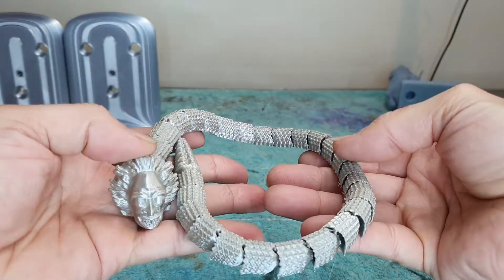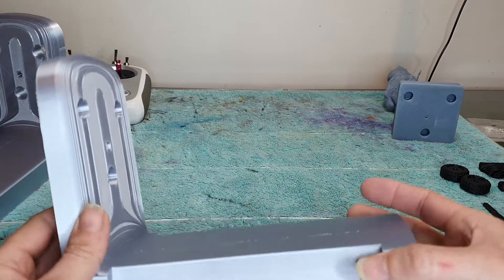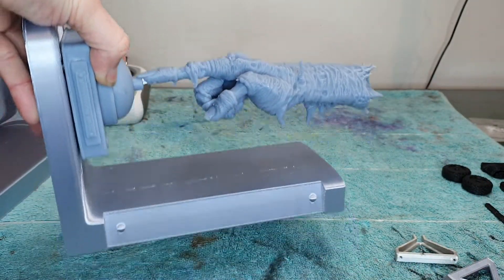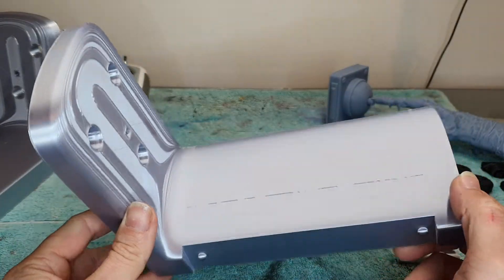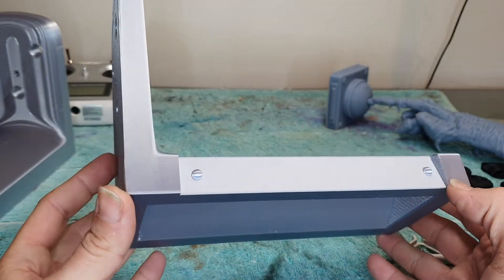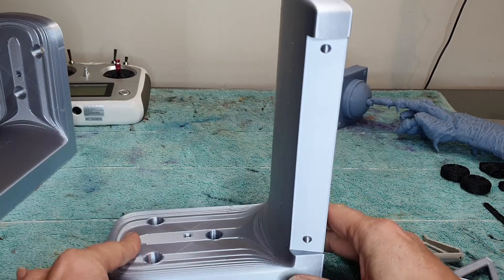He's all articulated and everything — again he was just printed like that on the bed, popped right off. Prints are popping right off too — I'm not having any issues with prints not sticking or sticking too hard. I decided to throw on a big piece: these are the stands for the House hand display from the movie House. I thought I'd print it in FDM just to see what would happen. This worked out to be about eight dollars to print and took 26 hours. If I was to do this in resin it would have taken about 13 hours and probably cost around 35 dollars with the resin I'm using, because it's quite a big piece.